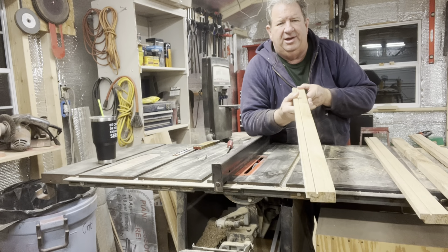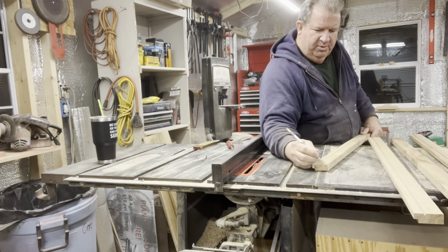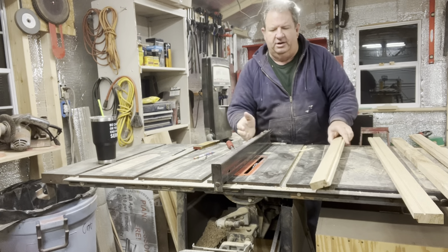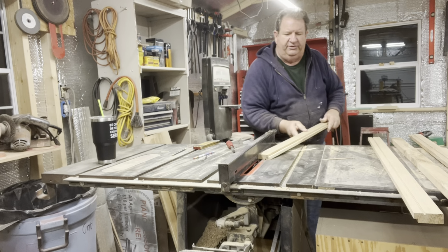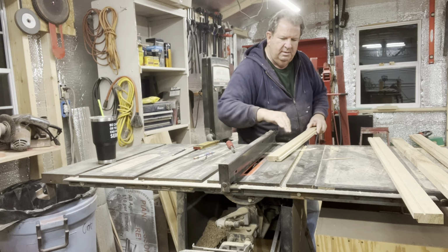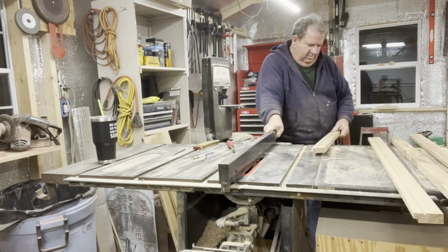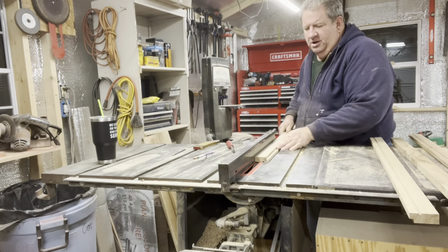Width in that groove down through there. And then what I'm going to do, I'm going to put another one right beside it. You can kind of see where my pencil mark is. I'm going to put another one there just like that. So we're going to have to move this. Actually, it's got to go closer to the blade. You can get yourself messed around, confused here real easy. All right, let's tighten that down. See how that comes across?